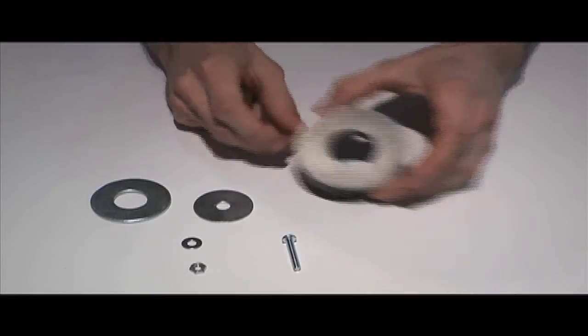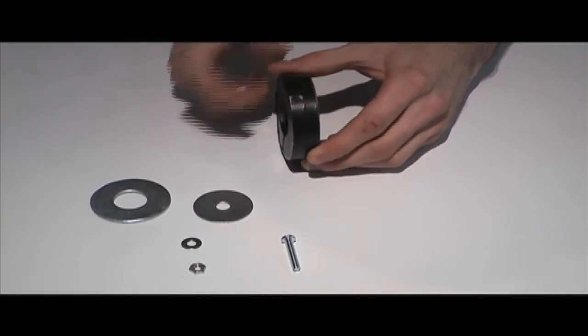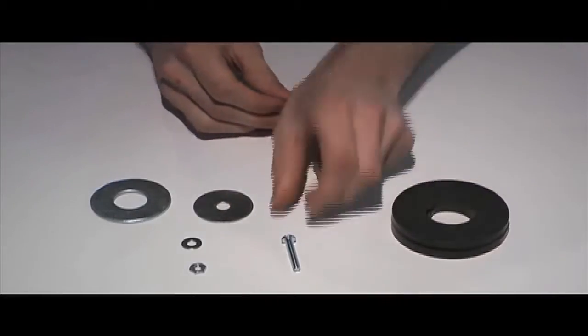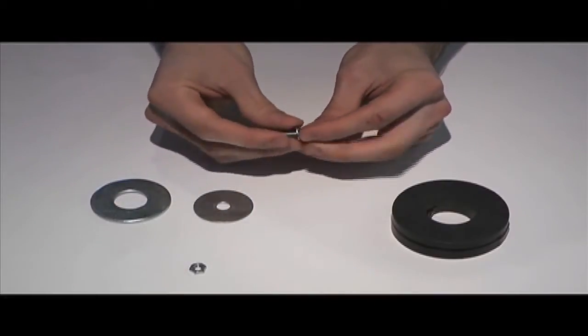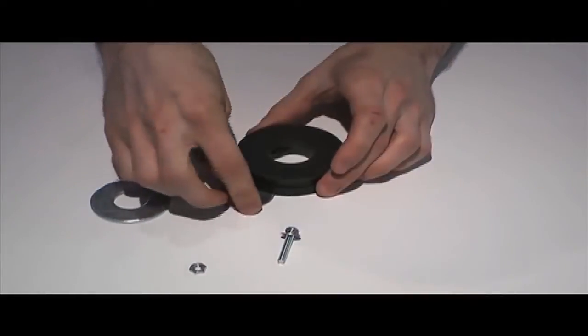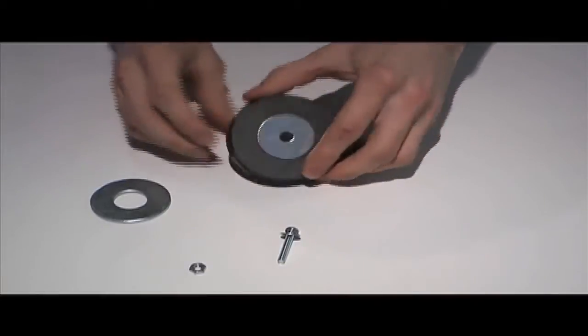The first thing we want to do is put our magnet together. Here you can see the 2 ceramic ring magnets taped together with electrical tape. Take the 1032 washer and place it onto the screw. Then, take the 1/4-inch by 2-inch washer and the 1/2-inch by 2.5-inch washer and place them on either side of the magnet, making sure that each covers a respective ring.